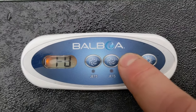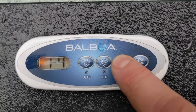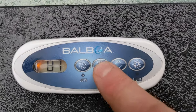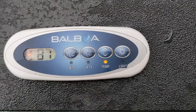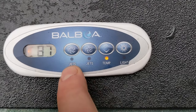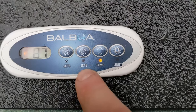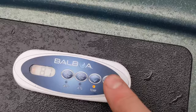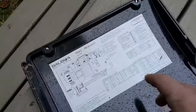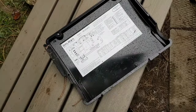It was on FC — that's why it wouldn't stop running. We're going to set it to every four hours and go back to pump one. Pump two is over here, but if you look on your schematics on the back of the board, this shows as blower, which could be pump two, and then pump one — that's why you just have 'jets' and 'jets' instead of a number. That was our problem: continuous running. You're going to have to change the filtration setting, or the pin I showed you. Make sure it's not on 24 hours.